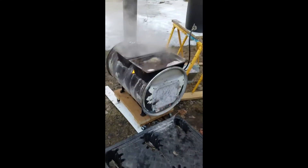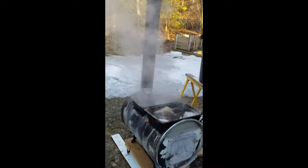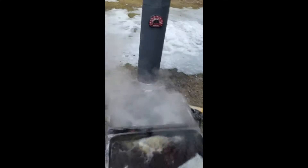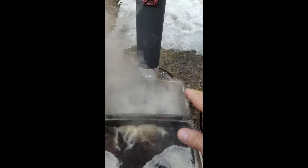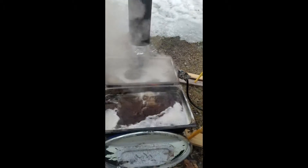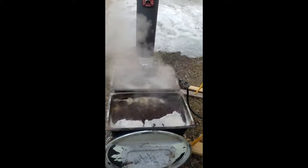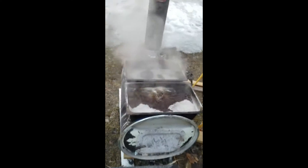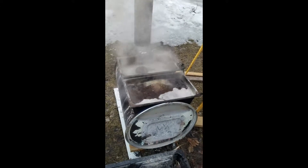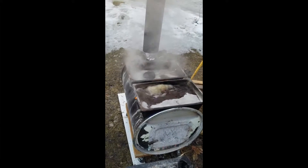This is the barrel stove — typical barrel stove kit. Highly recommended six-foot stack. I had to drill some holes in the barrel stove kit over by the damper because it doesn't come with any. I don't know what their plan is to attach it — I guess they figure you're going to attach it to the wall. Without that there's really no way to attach the pipe, so I drilled four holes in the cast iron. It actually drills really easily; it's not a real hard metal.